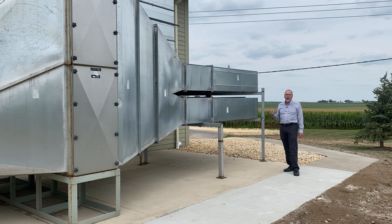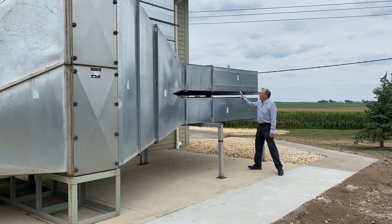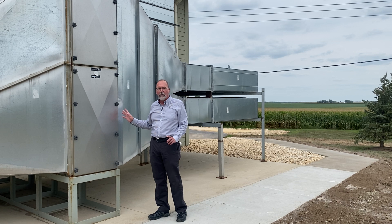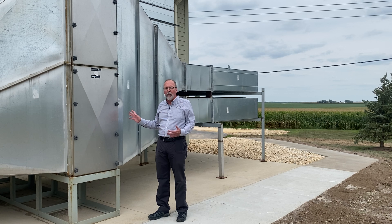This is the exhaust side of our ventilation system. At Smoke and Gunworks we have an upper range and a lower range, so this system is separated to take air from both ranges, combines it into this section, and this is where the filtration happens. It has the paper pre-filters on this side to remove heavier particles before the air moves through the HEPA filters on the other side of the ventilation door. It's a very quick air exchange, and again, what we exhaust is always cleaner than what we brought in.